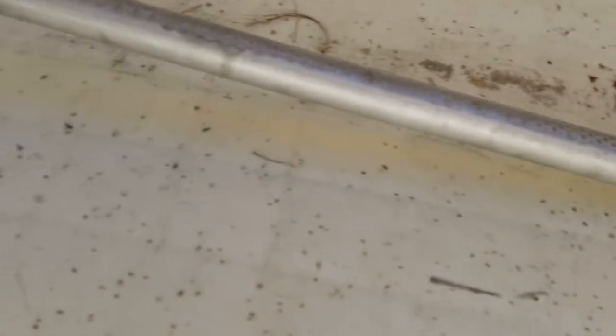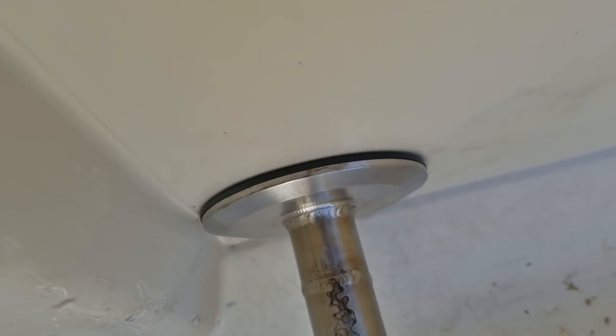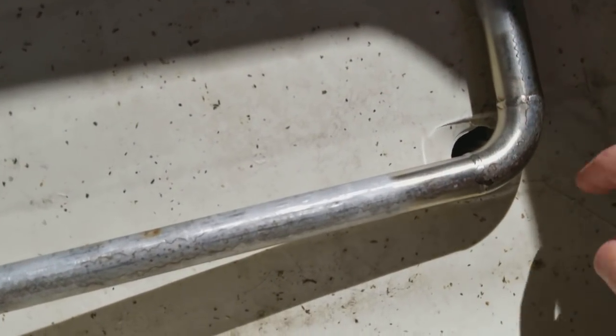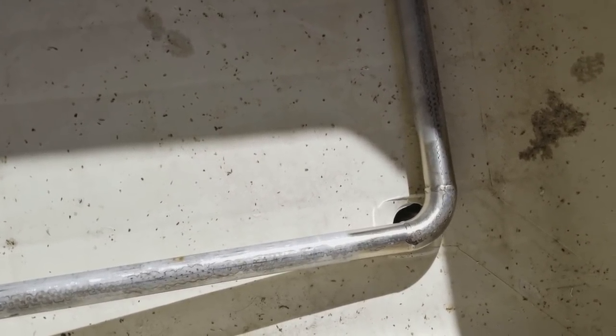I got the bags out and we're just going to assess the damage. As you can see, the steam coil has melted right through the bottom and just started here as well. The only reason it didn't get all the way through is the bulkhead gave it a little bit of resistance, and there's a gasket between the bulkhead that was enough to stop the heat transfer. This area has not been affected by the heat at all and the tank itself is fine. I'm going to get some coreplast, cut out little squares, silicone all around the holes, and seal them with a coreplast seal.